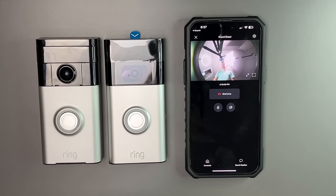If you're going to hardwire your ring doorbell, you need to cut off power at the breaker box to the power outside your front or back door, wherever you're placing it. Check the label to see what is on each breaker. If you don't know which one it is, your best bet is just to cut off the main, then turn everything back on when you're ready. Now that we've cut our power, we can go ahead and remove the old one — two screws and then we take it off. Then take out the actual wires, and grab a piece of tape so the wire does not fall back into the house.